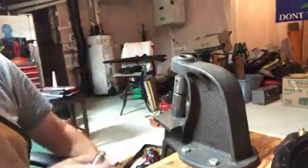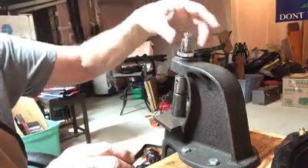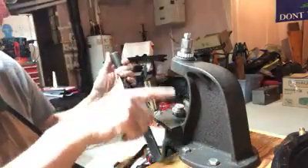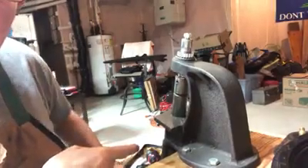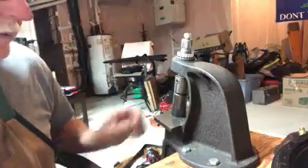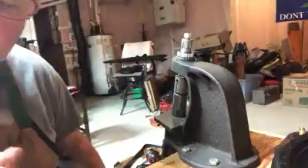As a simple process — this is a single stage press. As you can see, I have the proper shell holder in. I have the ram up and I'm just going to screw the die down until it touches the shell holder. So now it's touching the shell holder. I'm going to lift the handle to lower the ram, and then I'm going to turn it another quarter of a turn like that. On my press, you can feel it kind of cam over. Other presses might be different, but a lot of single stage presses like this have a cam-over feel, and that just tells you it's going as far as it can go.